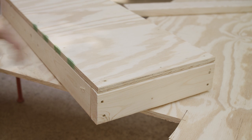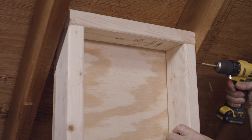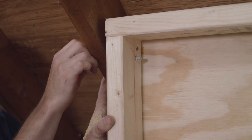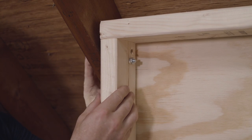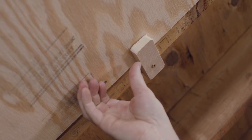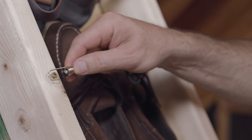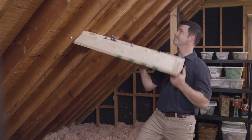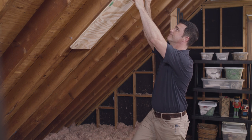This will be your storage box. Hold the box in place and drill a hole on either side, through the box and the roof rafters. Place carriage bolts through the rafters and the box to act as a pivot point. You can secure the box in the upright position with an eye hook or a wooden cleat on a slightly loosened screw. A small board or bungee cord can hold items in place in the vertical position. Don't overload these boxes — if they get too heavy, it can be unsafe to open and close them.